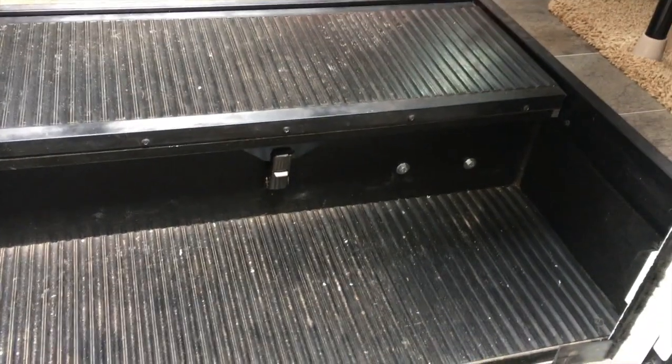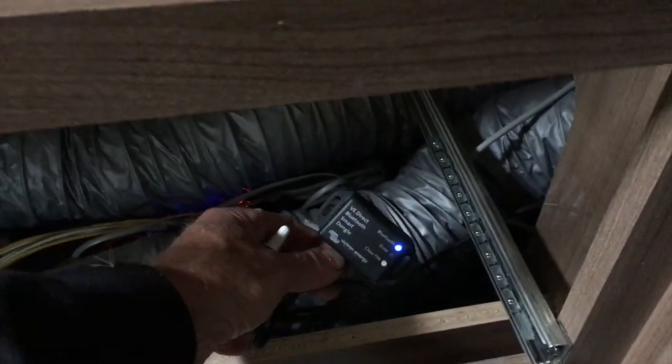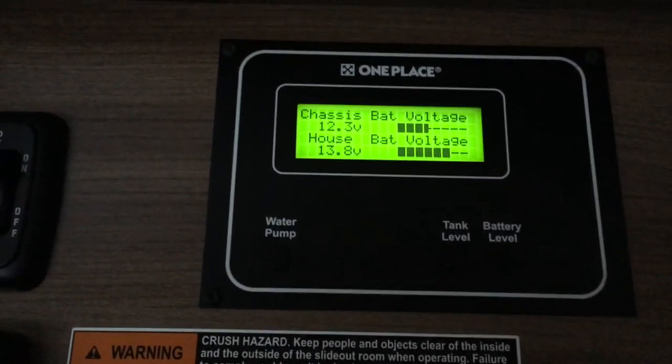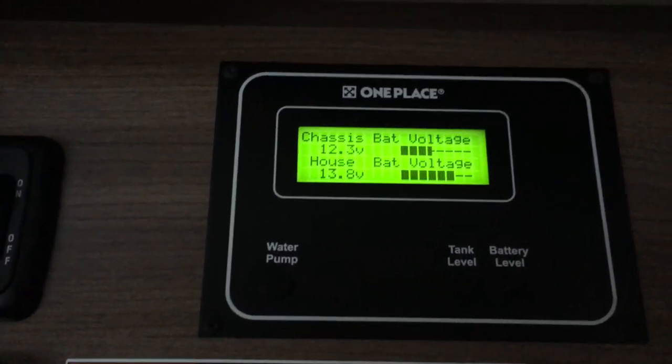That's the finished product — there are just two bolts holding on the shunt for the battery monitor. That's the finished battery monitor in place underneath the refrigerator, and I'll just put the drawers back in. This is the Bluetooth dongle, which communicates with my phone to tell me the history of voltage use. I can see on the battery levels that my batteries are looking pretty good — they've already dropped down from full charge and are going down to more of a float charge. That installation is complete.